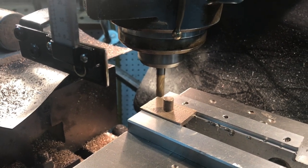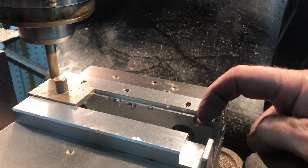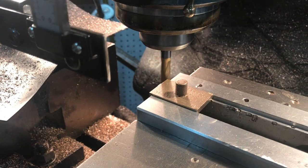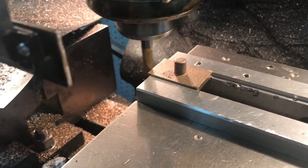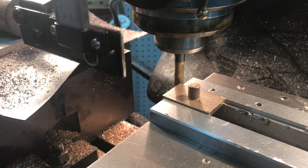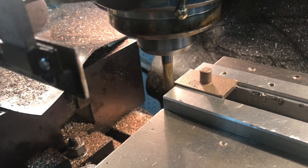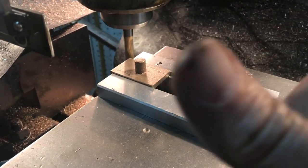Here we are machining the steam chest covers. I tipped them up on the end with the little nub and a parallel to trim them lengthwise. Now I've got it in the soft jaws — just cleaning up. I'm going to take off about 30 thou on either side to get to the right width. I'm doing about 6 to 7 thou at a time, very light, because I don't want to knock the piece out of the soft jaws. Also notice that when I'm doing the climb mill I'm not cutting anything, because the climb would have a tendency to push it up and out.